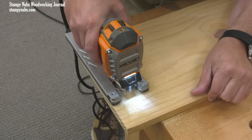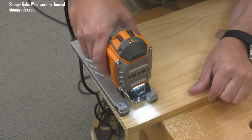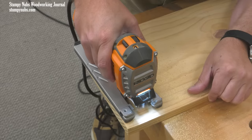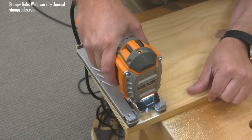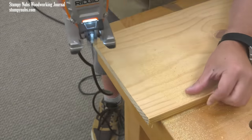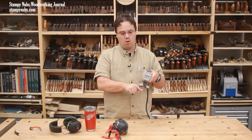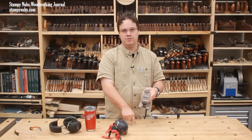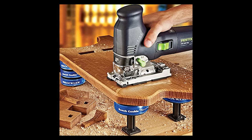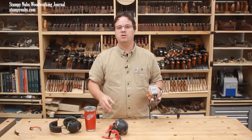It's a common practice to just let the board hang off the edge of your workbench as you cut, and that's fine as long as there's enough wood on the bench top to keep it stable so it doesn't shift while you work. If in doubt, clamp it down. Another option is to elevate your workpiece so the blade can go all the way through without going into your bench top. Riser blocks or bench cookies are really handy for this, but they don't have to be fancy — you can use scraps of wood or even chunks of styrofoam.